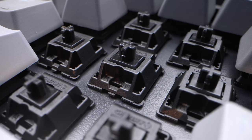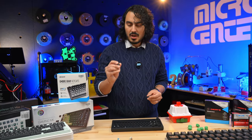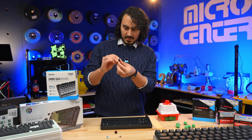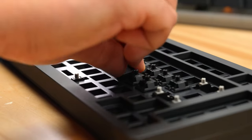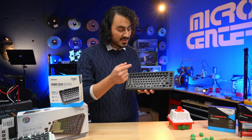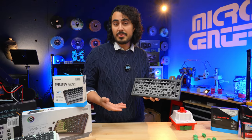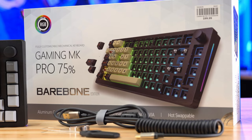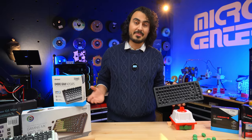For this build, I'm going to go with the MX black switches. Usually I use reds, and I do like a good linear switch, but sometimes reds can be a little too delicate and you can press them down accidentally. The blacks require a little more force for a full press. Now, this is a hot-swappable base, meaning you can swap out the switches at any time since they're not soldered in. If you try blue switches and find they're too noisy, you can just take them out and put in some browns. That's what I like about these — they're very versatile and give you a lot of options.